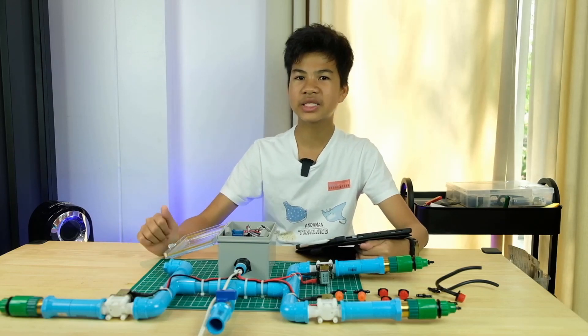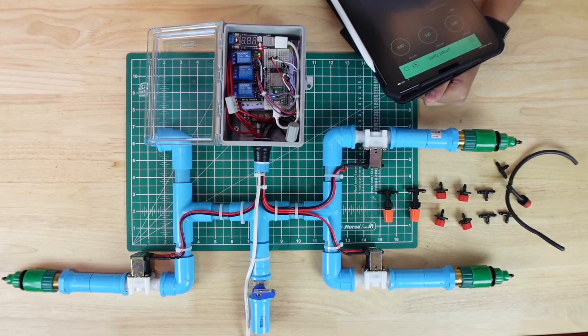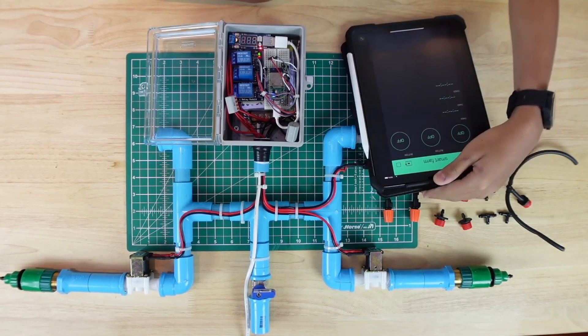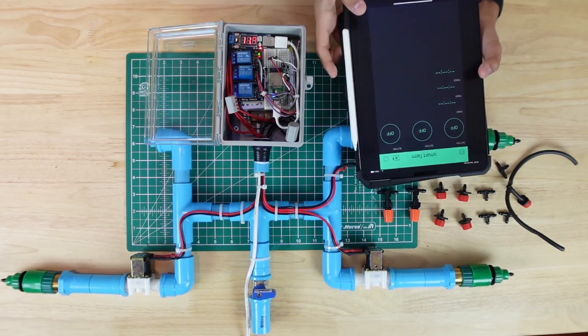If you want to know how to write the code for the ESP, you can look at my previous video — it would be the same code, and I will put it in the description so you can use it. Now I'll talk about the hardware in this box. We have the power supply which converts 220 volts to 12 volts. These solenoids require 12 volts. From that 12 volts we need to step it down to 5 volts to feed the relay and the ESP. The power from the 5 volts goes into the ESP. Just keep in mind that the ESP operates on a 3.3-volt architecture, meaning it will only work on 3.3 volts — so this relay is 3.3 volts.